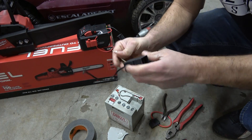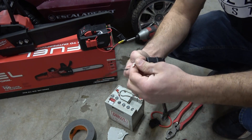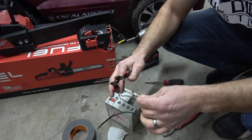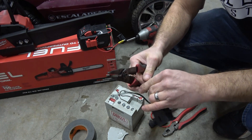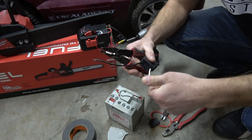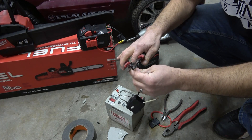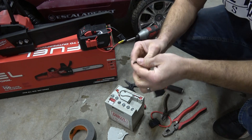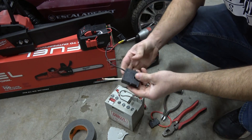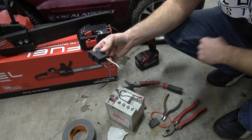This connector is kind of like the pearl inside an oyster — this is what we were after. Any wire that's damaged, back it off so when you strip it you have about a half inch of clean wire. This is the next step: we are going to prep our connector. This wire actually looks black inside, so it may have had some overheating. This connector is going to plug into your stock wiring harness.